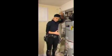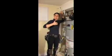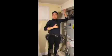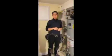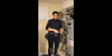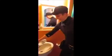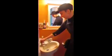Just as a straw, when you dip it in your drink, if you put your thumb on it and you pull it up, doesn't drain when no air is coming into the top, your tank won't drain if there's no way for air to go into the plumbing system. The way to allow air in is to go upstairs and open a hot water fixture. A fixture with a mixing valve, just a single handle, won't do. You actually need a hot water fixture ideally. We're going to take a quick break as I run upstairs and open that water fixture. And opening the hot water fixture just a little bit. All set, going back downstairs.